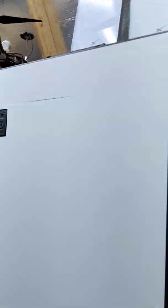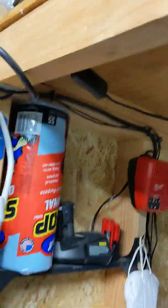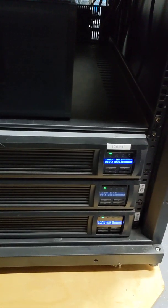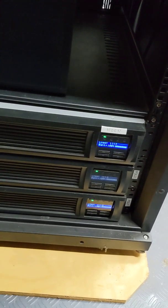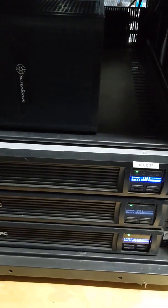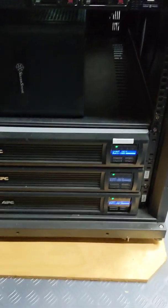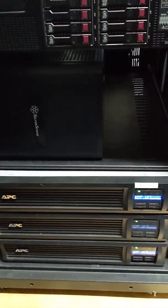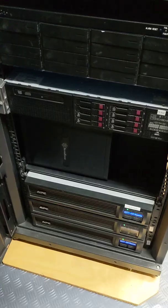So that's pretty much the power breakdown. For the server rack power, I have another one of those Emporias that monitors everything going into the rack. The rack itself has three APC 1500 units. The top two are daisy-chained to each other. The bottom one is dedicated to only the two Starlinks, the pfSense router, and the switching that happens inside the rack. The top one doesn't have great batteries — it's got some cheap ones from Amazon and they just don't seem to last as long. The bottom one will run for like 35 to 40 minutes and the top one only runs for about 25 minutes. I don't know if it has anything to do with the fact that the sine wave changes slightly when it's under battery power — maybe that just doesn't last as long.